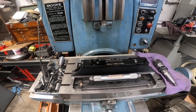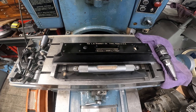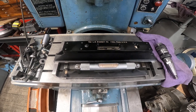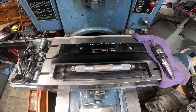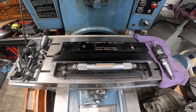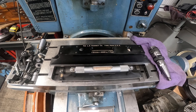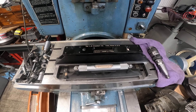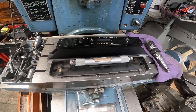What I'm going to do is level the machine. It sits on three points, one of them being right at the front. There are some bolt-down holes on the sides but you don't use those — those are only for transport. It sits on three points, so it's fairly easy to level. You just pry this 4,000-pound machine up at those points with a bar and slip shims in, or wedges, or whatever you've got.